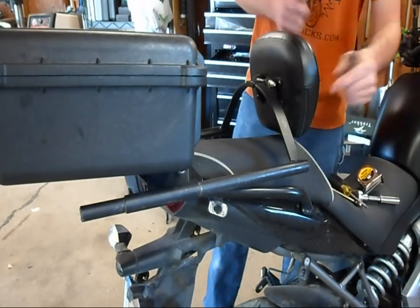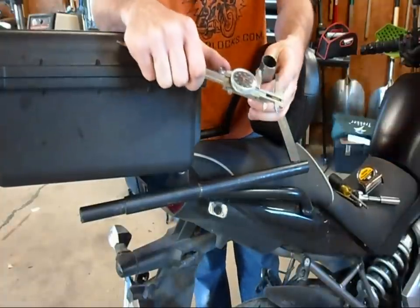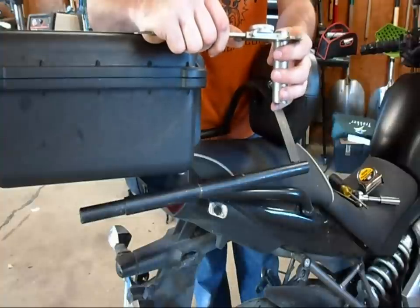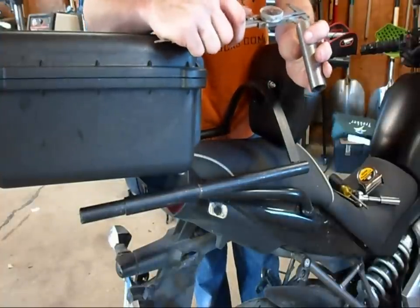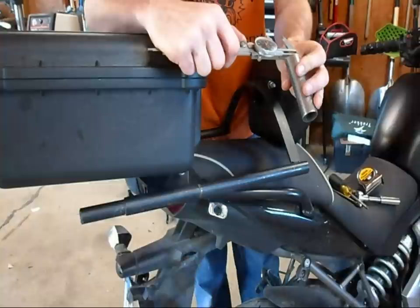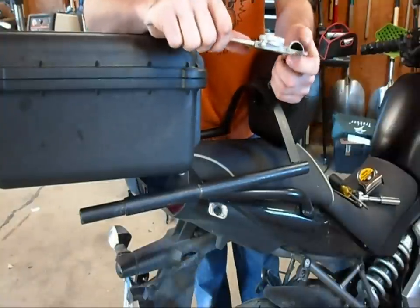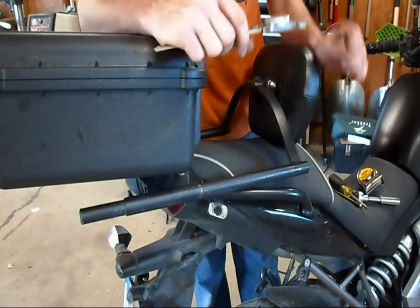The pipe that this slides into is seamless pipe, and it is near as makes no difference an inch exactly on the outside, and 85 hundredths of an inch inside. The wall thickness is the difference — do the math.